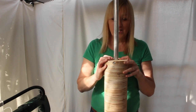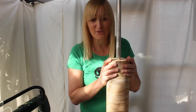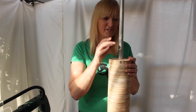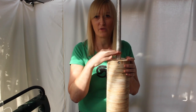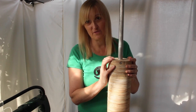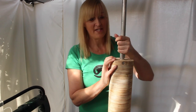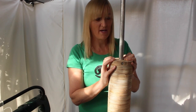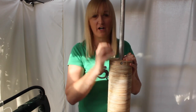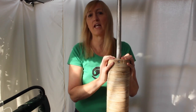I'm really pleased with how the engineering went. The tolerances on this are incredibly close. I'm going to have fun as the next step trying to get this into the bearings, because this measures at, I think, 25.3, just a fraction under an inch. And the bearings measure as 25.3 as well. And I don't think they're going to slide on. I'm going to have to sand something down, whether it's the inside of the bearing or this. Maybe if I just clean it up with a little bit of wet and dry, I'll be able to get them on. But I want a close fit anyway. But that's for the next video.